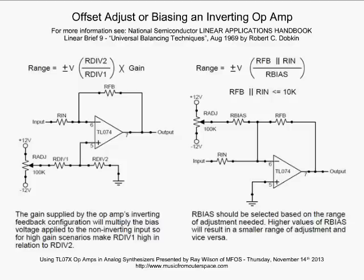And if you have higher gain, again, you may have to make your bias even higher, or break the bias into a kind of 3-resistor divider, where coming right off of the wiper you'd have a resistor going to another resistor to ground, and then a third resistor basically taking the place of our bias and going into the inverting input. Then you could really attenuate what was coming off of this trimmer with that little network. Even if you have high gain in your amplifier, you can still reduce that offset adjustment to just a few millivolts. But if you want more, reducing our bias resistance in relation to our feedback is going to allow this pot to give you a lot of adjustment of DC offset on the output of your amplifier.